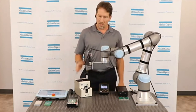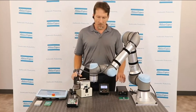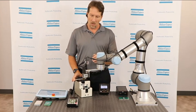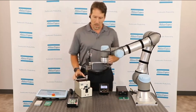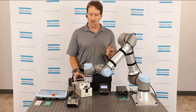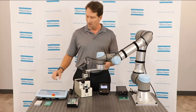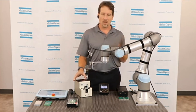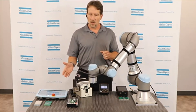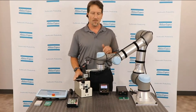We're going to run one more screw. We go to the screw presenter, pick up the screw, and place it into the part. The vacuum pump is actually very quiet — it does not kick on until the robot moves over to the screw presenter and then shuts off again once the screw is installed. At some points in the sequence, the robot may not pick up the screw properly. We can set the system to retry up to three times, and if it fails after three attempts, it will send a signal through the network to alert someone. If the final installation has any problems, we'll get a red light on the fixture and on the controller, and it'll send a flag to notify someone.